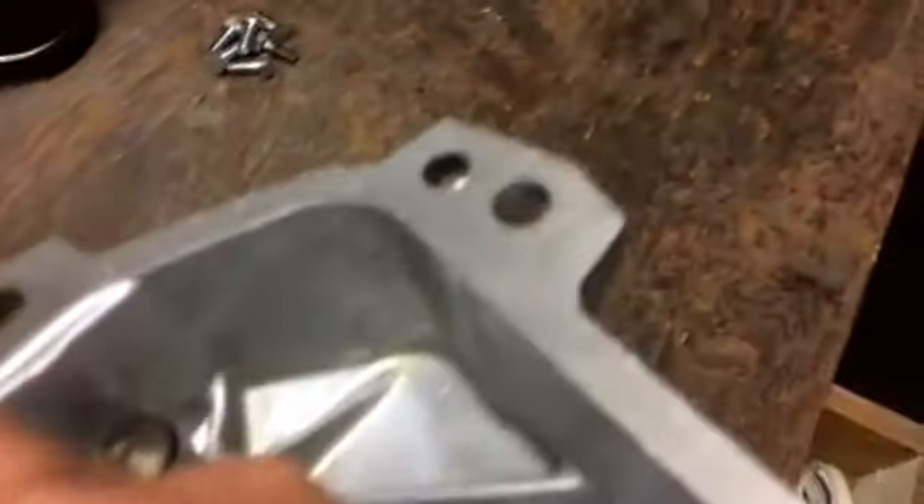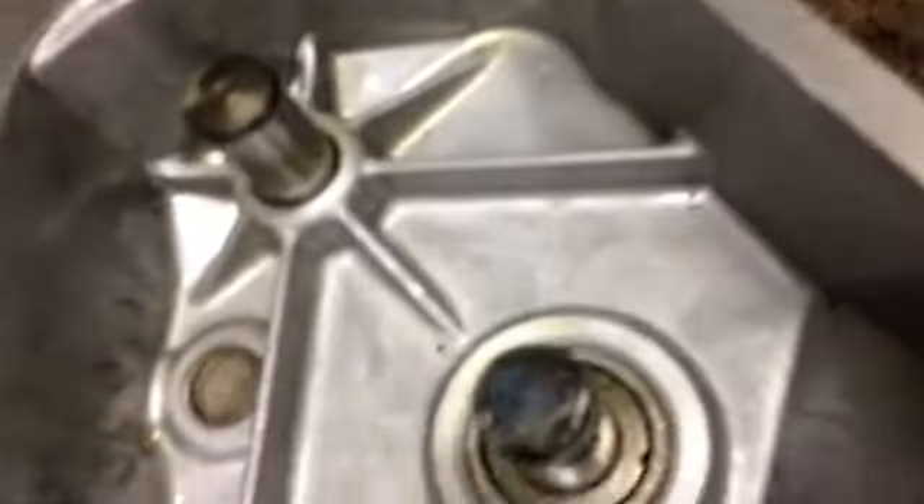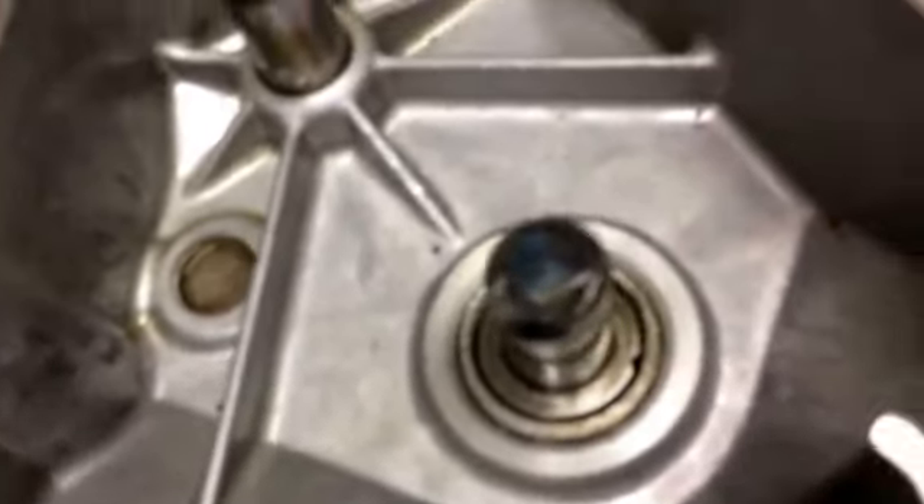Transmissions are too expensive for these things, used or new. What happened was this gear broke off that shaft. So I'm going to find somebody to weld this for me. Looking at it, it's either a break or just a crappy weld job to begin with. I don't know if the shaft comes out, but taking a look at it I don't see how it does.